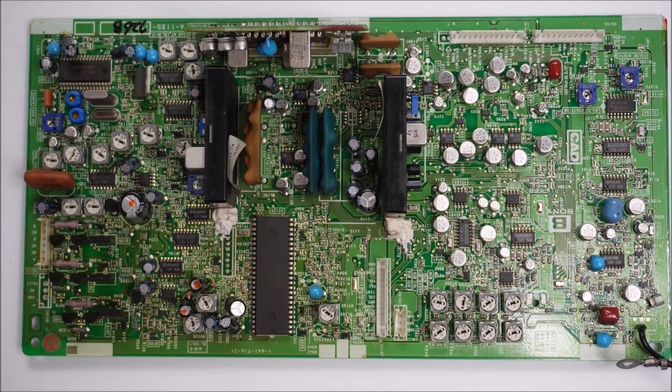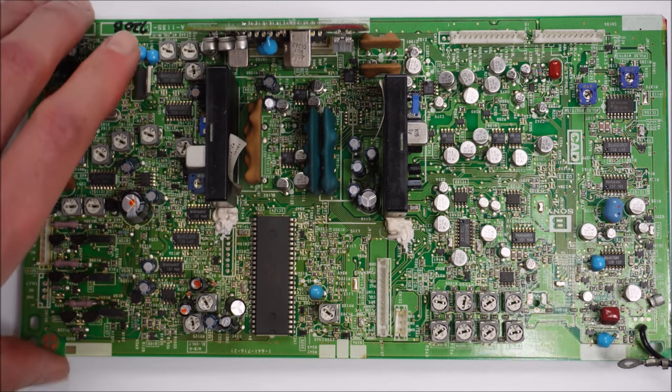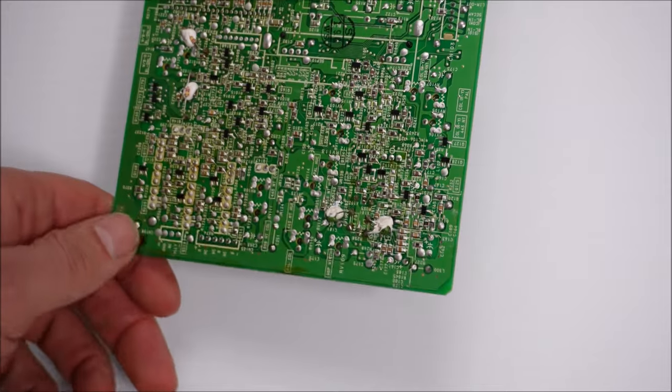If you open up your monitor and locate the trimmer capacitors and see that they are both blue, then you've already had the fix applied and you shouldn't need to replace those at all. The blue is a giveaway. The blue trimmers are a different style altogether than the orange ones. Also on the back is a telltale sign.